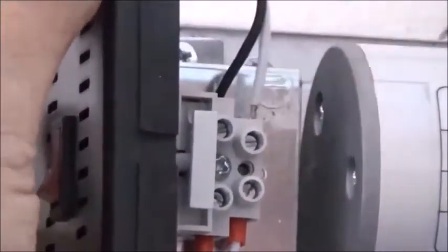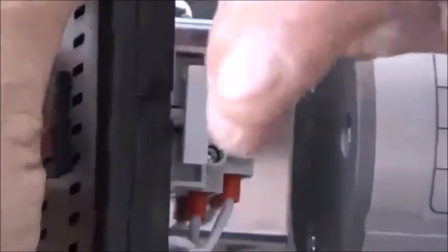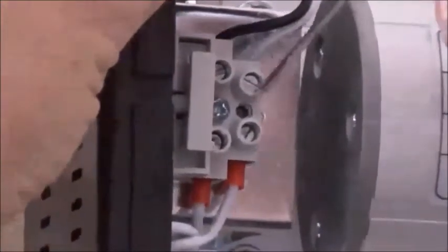Black is hot, white is neutral. Give them a little touch to check — always check it that way, and I'm glad I did because it was a miss so I had to back up my screw. I'm kind of glad that happened. Definitely sunk my wire this time.